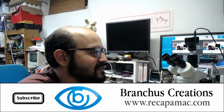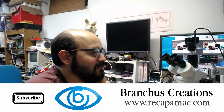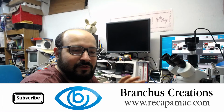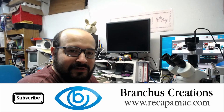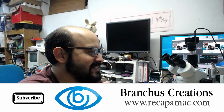Yep, I mean, some of this stuff is very hard to get by these days, these old computers and such. Got a great iMac. Been looking to get an iMac G4. Oh, G4 upgraded. I would just go get an iMac G4 or a G4 Tower. What people forget to think about when they upgrade the CPUs and the processors of these computers is the bus speed. If you're upgrading the processor, you are not upgrading the bus speed. So if your bus speed is 60 megahertz and you put a G4 in there, okay, you got a G4 with a 60 megahertz limitation on the bus. So you're better off just getting a new computer. I mean, that's just my opinion.